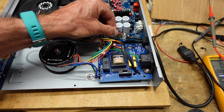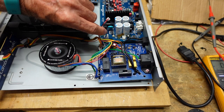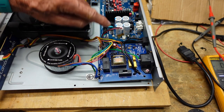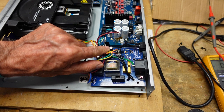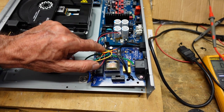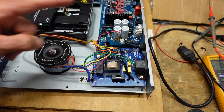However, when I measured here I got almost a dead short. So I'm going to start back from here and check and see what might be shorted. There's a small capacitor here that may be the culprit. This regulator might be bad. I'm just going to see where these two wires come out and work my way back from there.